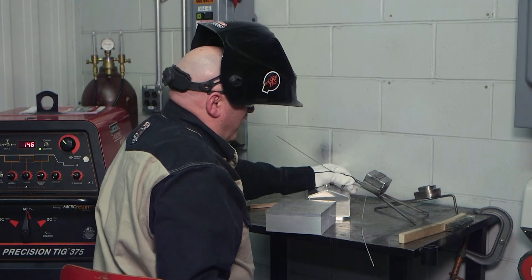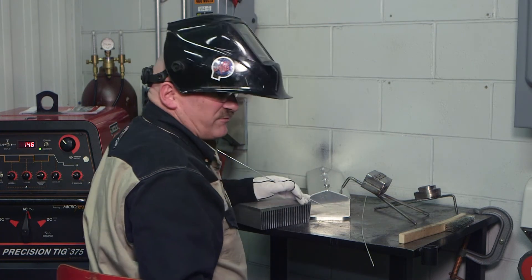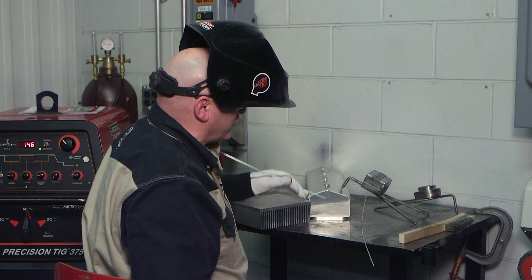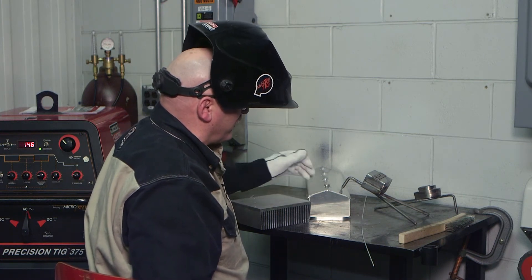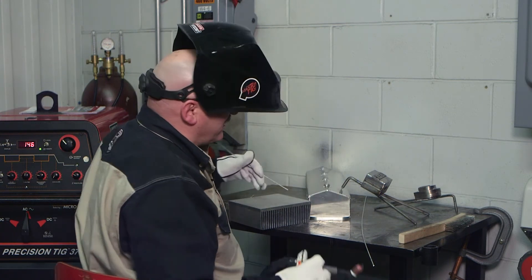I have a little auxiliary ground here, and it's on there for a reason. Although this piece is destined for the scrap yard, I'm still trying to display that we want to keep a good ground on the part. I probably wouldn't want to put the ground on that finished surface, as I really would not like arcing through on a part that's been machined.